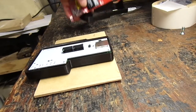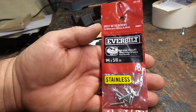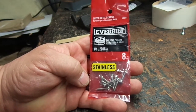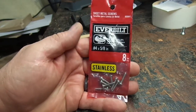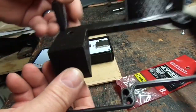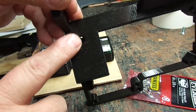What I'm going to use is stainless steel pan head screws. You can order the M3 by 0.5 pitch but it's really not needed — these screws will work just fine if you modify the depth on this hole right here. That's what we're going to try to do today.